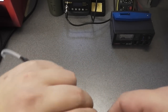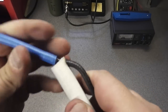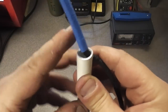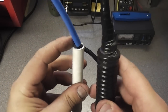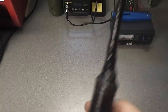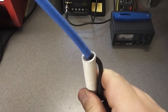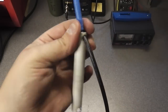This is where the prototype lets itself down because there's no rigid support in there for the antenna — with the prototype I just built it up with electrical tape to keep it straight. When I make the proper version that will all be sorted and the antenna will be nice and secure. But for now it does work, and that's the main thing. So you've got the bottom of the antenna there and you're going to start winding your balun.